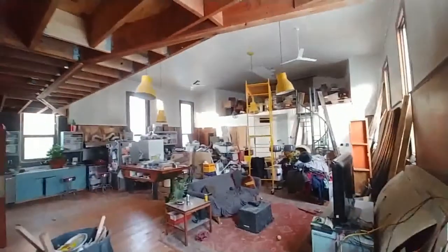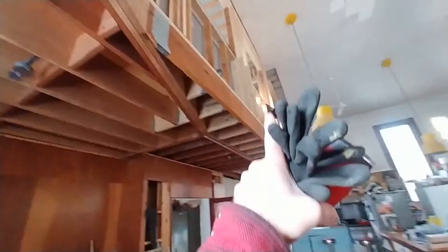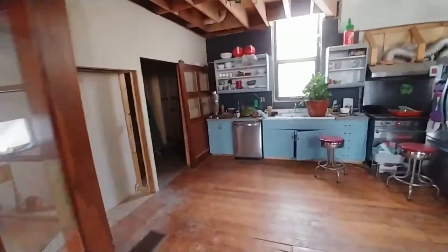So since we have the Baker scaffold and drywallers here today, I think we're going to ask them to get the front of our dividing wall up there. And then we've got the pantry, where we put the stack through at the beginning of my journey here. I don't know if you can see the light there. I need to pack this wall out 3/4 inch because it is still just a little bit proud of the surface of the wall up there. So we've got to add 3/4 inch behind me, pull some wire and do insulating in here.